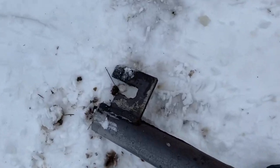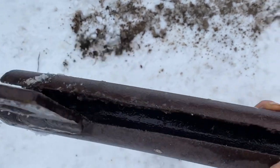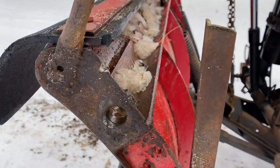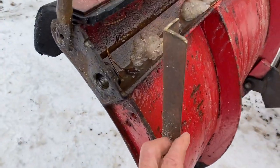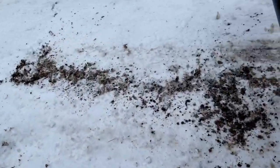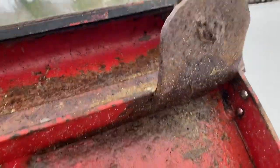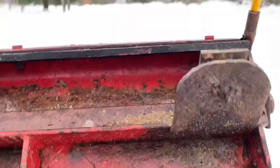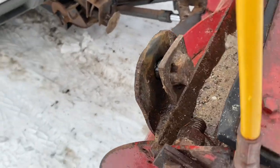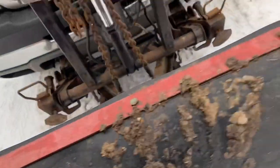This end is just a piece of steel welded to the end of the pipe, in front of the slot. Up on top here there's another hole it slides into. This piece of angle iron is just to keep it from flopping as you hit bumps. On this side, I've welded a piece of metal right to the plow — I bent it up a little bit — and welded a bolt through it with basically just a big washer. What I had was square, but you could just use a round washer. And that's what holds the other end in.